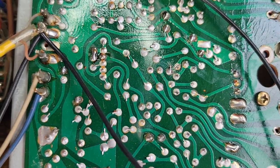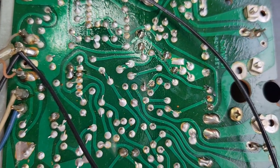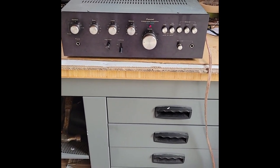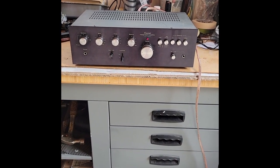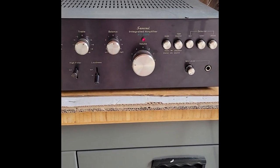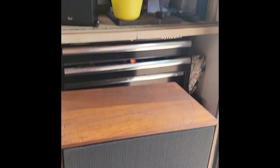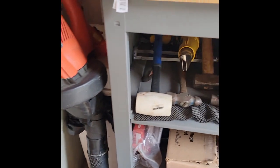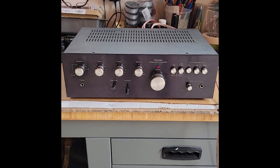And lo and behold, that seems to have solved the problem. I've got clarity on the unit, no popping, and the relay is no longer cutting out and stopping the amplifier. Here are the final results of my repairs — re-soldering some of the transistors and replacing the larger capacitors in this AU3900 Sansui. We had crackling and popping, and as you can tell there don't seem to be any issues. It's been running for about five hours, everything seems to be fine, no noises, and the channels are clear and quiet. I think that would be called a success. Thanks for watching.